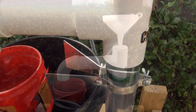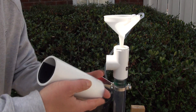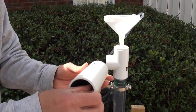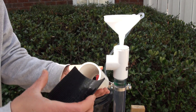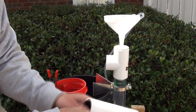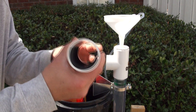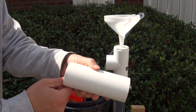Here's the other change we've made: on the tailings tube or screen indicator tube, we were going to glue the mat in, but instead we lengthened it so it has a little bit of bite. Now you can just pull the mat out, clean it, and put it back in very easily. There might be a piece of gold that gets under it, but that's okay — this is really not for catching gold, it's just your indicator.